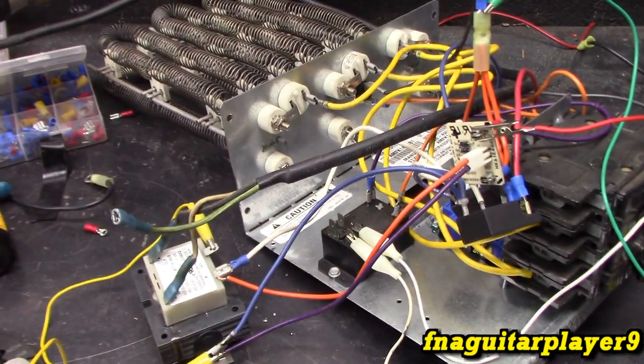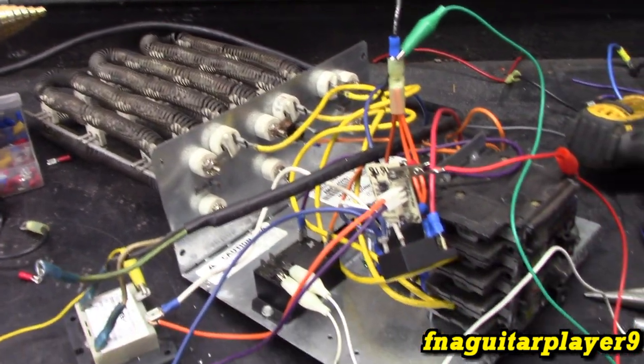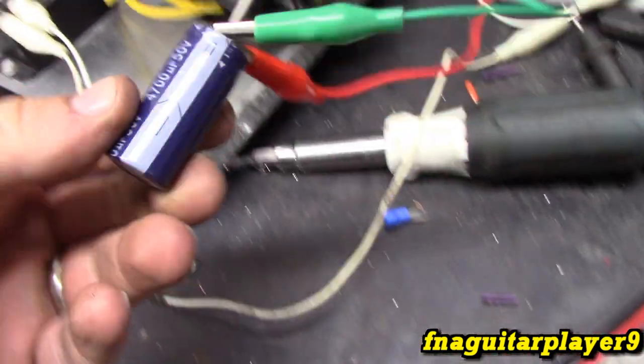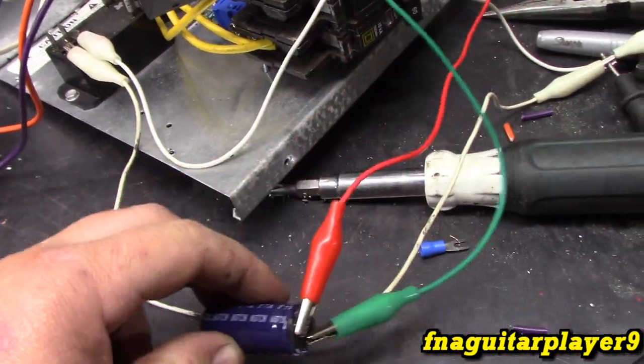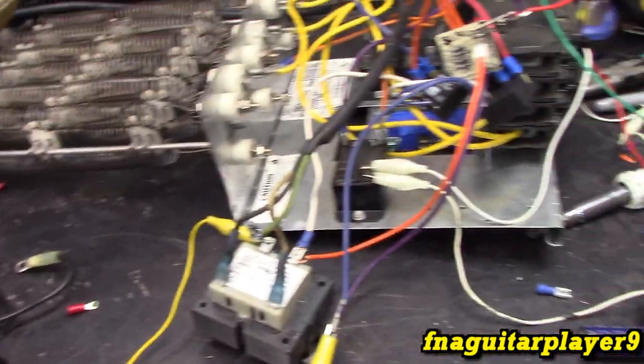I want the blower to run at least for a few seconds after the elements kick off. So as soon as the thermostat kicks off, I want it to run for just a little bit. So I got a 4700 microfarad 50 volt capacitor wired in parallel to this relay. So watch what happens. Plugging it in,